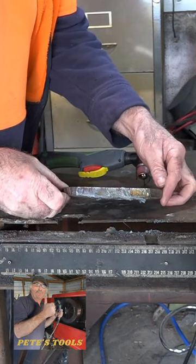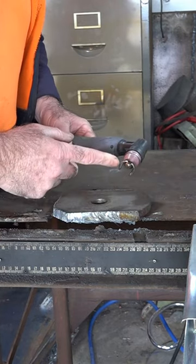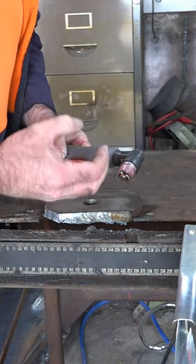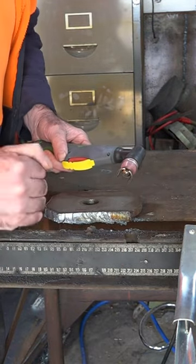What we'll be cutting is about 12 millimeters, or about half inch. The air pressure we use makes a huge difference in how long your consumables last and how much you can actually cut through. We need to have enough air pressure to spew all that plasma out the bottom while we try and cut it.